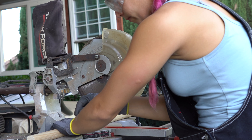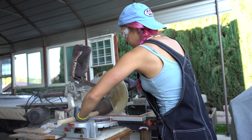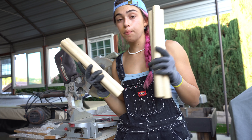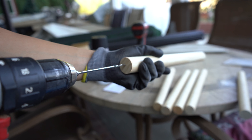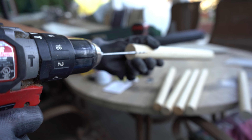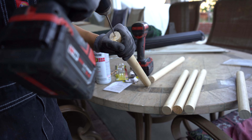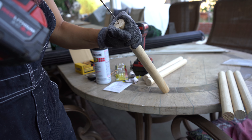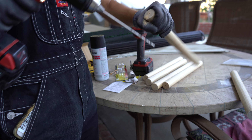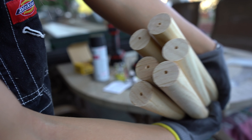One dowel done. Here's the plan: we're going to make pilot holes right here in the center, straight through, just so that when we stick these to the two-by-fours it doesn't split the wood. There we have it — a pilot hole. They should look something a little like this. My apologies to those with trypophobia. Now it's time to put this whole thing together.